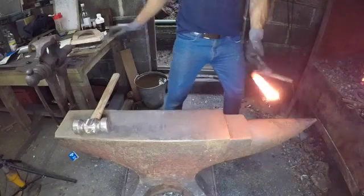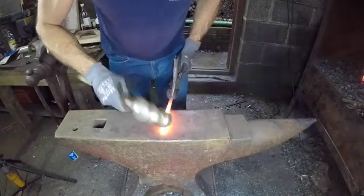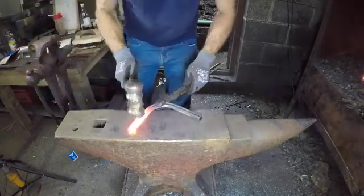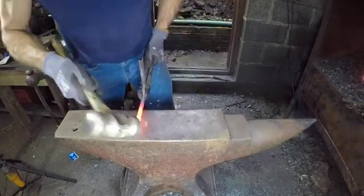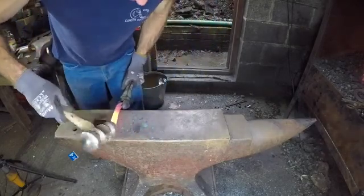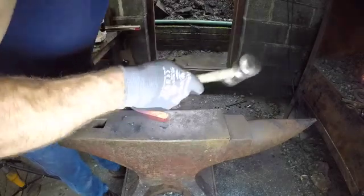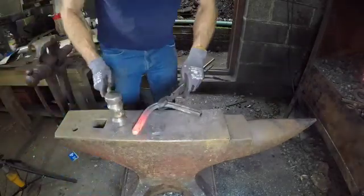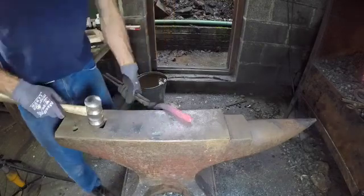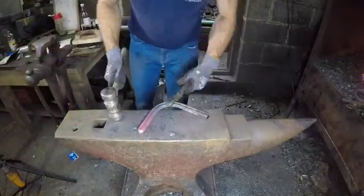Outside heel — a very important part of the shoemaking process. This heel is designed to fit safely in line with the frog. I'm just lightly folding the concave in on the inside section and then the outside section, keeping this concave on the anvil flat so that I'm not lifting with my tong hand at all. The tongs are in line with the branch of the steel and I'm constantly working inside to the outside, gradually bringing each bit in. I work the inside, then flatten it gently, then work the outside and flatten it again, keeping the steel on the anvil flat and using the roll of the hammer.